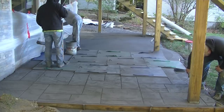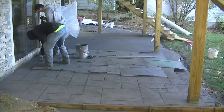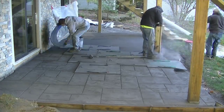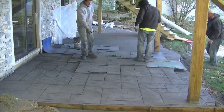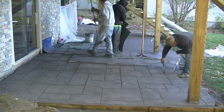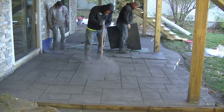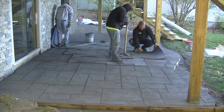How many of you guys work with stamped concrete? Do you use the dry release powder like we do, or do you prefer the liquid release? Sometimes we use both, but mostly we use the dry release powder. What that does is leave a secondary color in the concrete. We added an integral color — dark gray — and then we're using a black release. So it gives the stamped concrete a two-tone, antique-ish type look when we're done washing and sealing it.